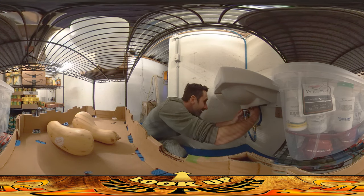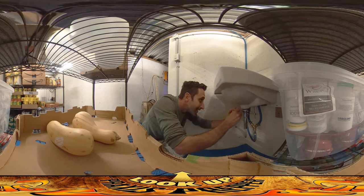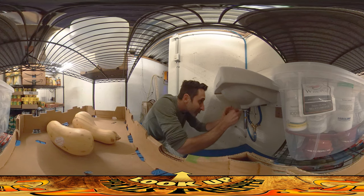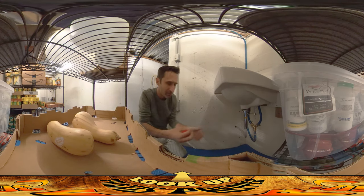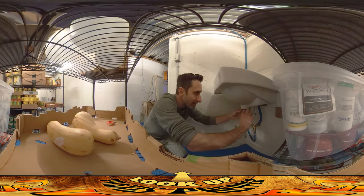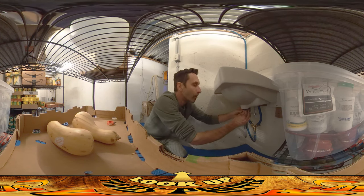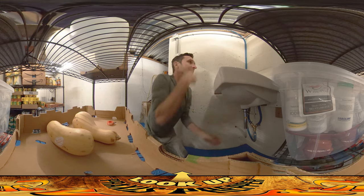So I'm holding that down and giving it a couple of wrap-arounds. I've never used Teflon tape for this particular joint before, but that's twice around — that should be fine. There's no pressure on this thing, it's just gravity pressure. Now that I've got that all nice, I'll screw this back up and we'll test it with some water in the sink up there.